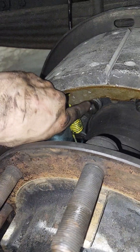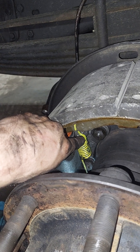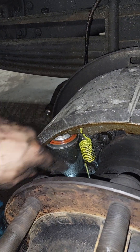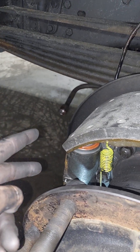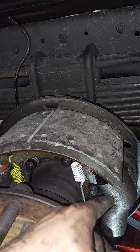Once you get that off, there are just three bolts — 21 or 22 millimeters. I believe I used a 21 on the backside with a wrench and a 22 out front. There are also two Allen head screws — like lineup screws. I'm pretty sure they're 5.5 millimeter, same as on the frontward cylinder.